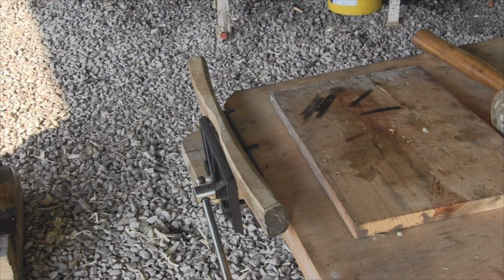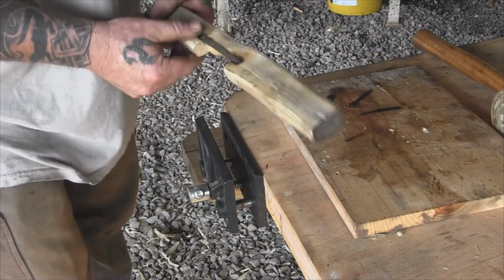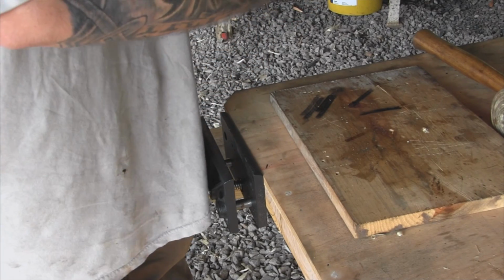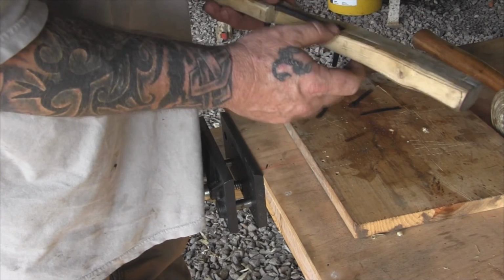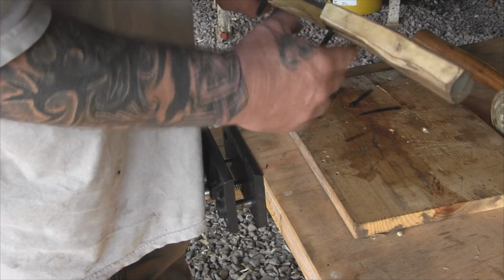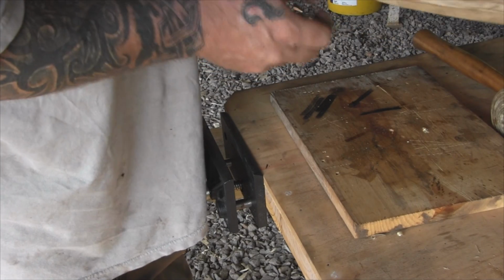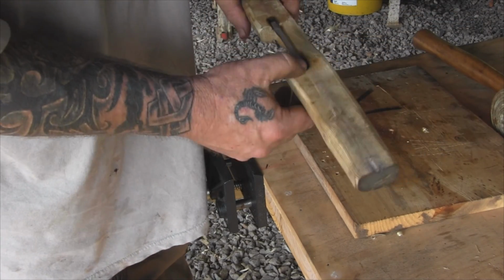So we've got our tool seated now. Just squeeze it in a vise here to seat it. Our gap doesn't look too bad. What we need to do now is we need to give it a final buff on a buffer just to knock the burr off of it. I'm pretty sure it would cut like a maniac right now. And then we really need to epoxy this thing down in there a little bit just to make sure it's not going to move on us.